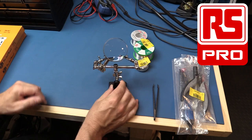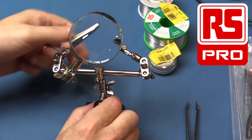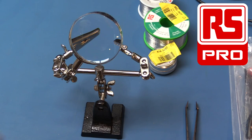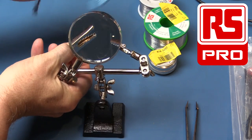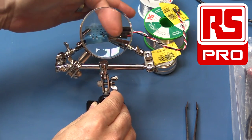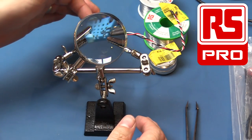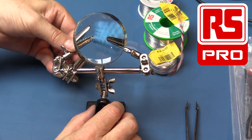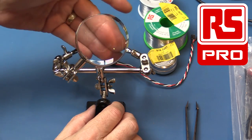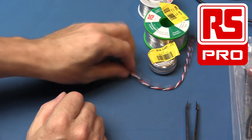This is the third hand. These have been around for years and years — even when I was an apprentice these kind of things existed. They're very handy when you're soldering wires and want to just hold something. You clip the device in the little grippers, look through the magnifying glass for a clear view of what you're doing, and solder away — much easier because you're not trying to hold the component as well. It's got quite a powerful magnifying glass, probably plus-three or plus-five diopter, and a nice metal base so it stays put.